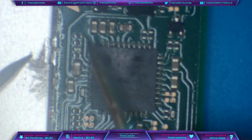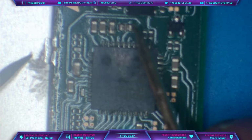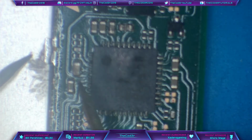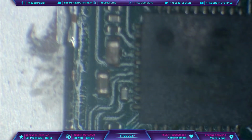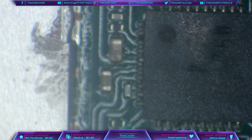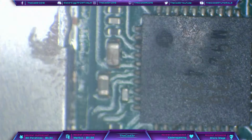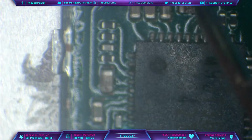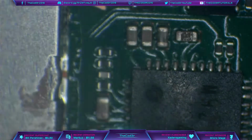And I already know that these input sides are on the bottom for these ones, and it's on the right hand side for this, and so on and so forth. But I'm going to say, based on the fact that we have a little bit of discoloration here, we may well have a short on this capacitor just here. So let's leave the goodies till last, and let's see what happens. Now, typically when we're going M92 short, it's this capacitor right here, this third one along. So let's check this row first.